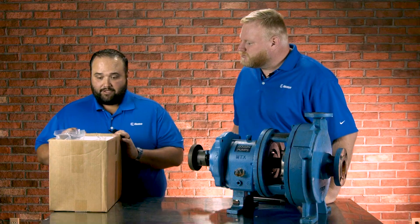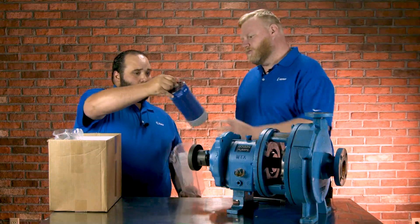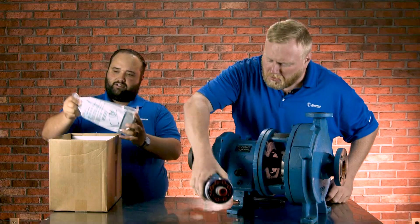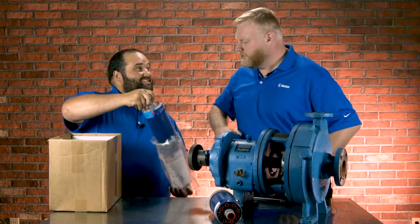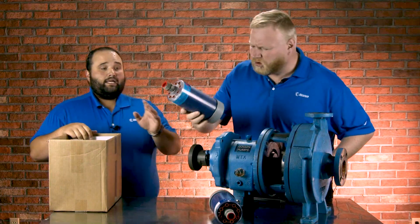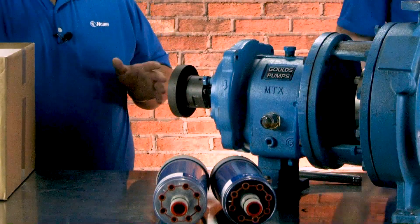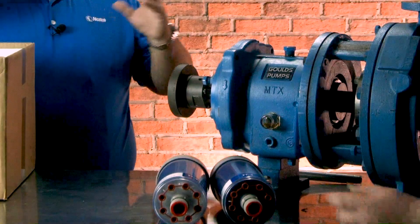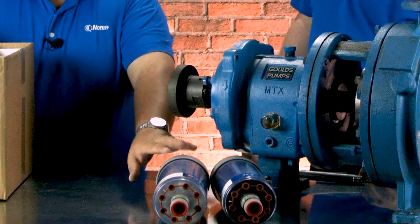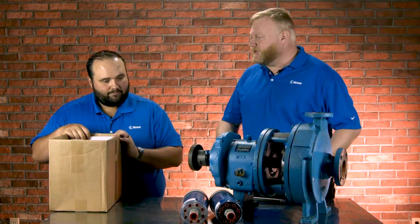TTI sent us some of their breathers, and one of the ones they sent us is the TT4 — a pretty decent sized breather, big capacity, going to last quite a while in service. Then there's the TT4-CV. The CV stands for check valve style breather. The TT4 has reticulated foam on the bottom and top to distribute air evenly and help mitigate oil misting. The TT4-CV still has foam at the top, but at the bottom it's been replaced with a couple of check valves.